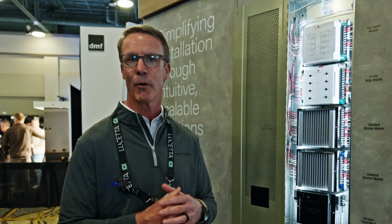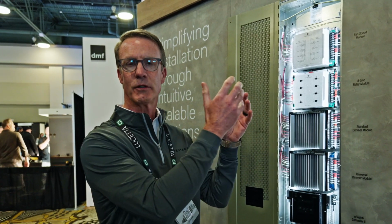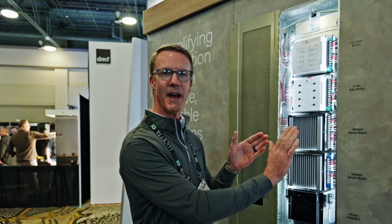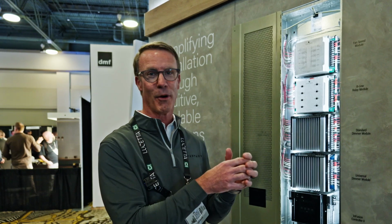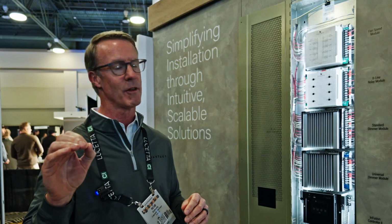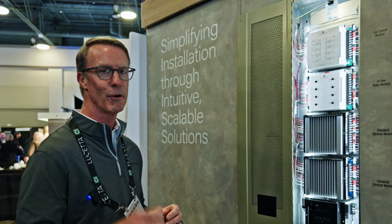Now, years ago, we created a Lighttouch insert solution. What happens if you come into an old Lighttouch system where the enclosures are recessed in the walls? We've created a UL listed sled that allows you to not tear out the Lighttouch enclosures, but install our sleds that house our modules. Really makes it easy. Of course, with our 2-wire bus, all you have to do is take the Lighttouch keypads out of the wall, put our Vantage keypads in, and you're done. We can use that bus to power and communicate our keypads. Very seamless, efficient way to upgrade old Lighttouch systems that are out there today. I want to make sure you all are aware of that.